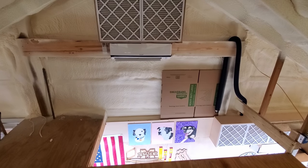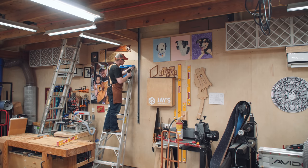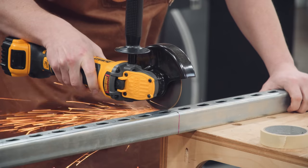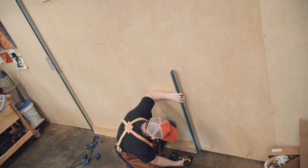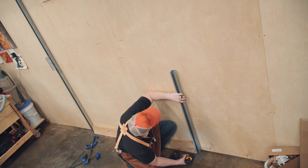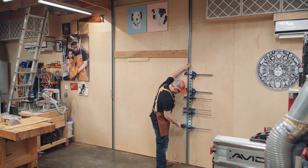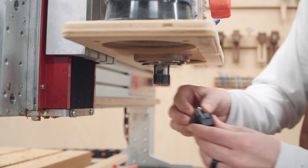So I just wanted to give you a view up here before I get these pieces mounted. Step one is to add the left side super strut referencing off of the left side of the opening and an inch or so below the horizontal mini split board above. A filler piece is needed to go below the full section on both sides, and I can go ahead and cut two pieces to the same exact length. The offcut piece was clamped to the side of both the top full section and the bottom short section to make sure they are perfectly in line when securing them to the wall. I secured the right side in the opposite direction, bottom to top.